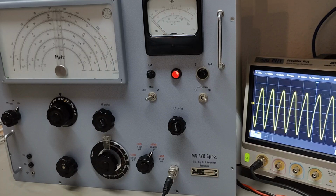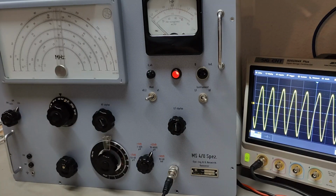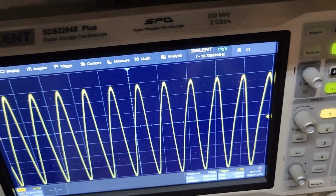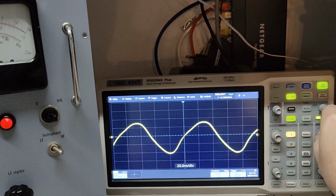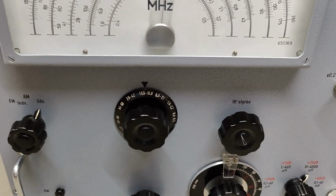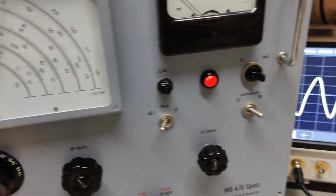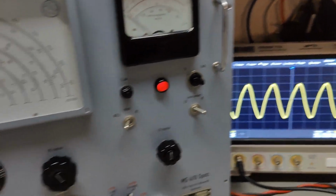And that is 10.7 megahertz, and that is exactly what I have done here. Oh, let's have a little look. So there you go, 10.7 megahertz is written right there. And yeah, it's not super clean, but that is how it looks. And what I've done is, that is the range for 10.7. Is this reacting? 10.8. And then 10.6. Yeah, all that seems to be working.